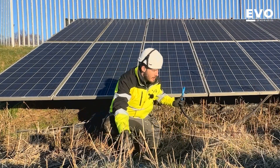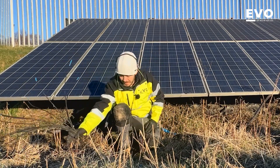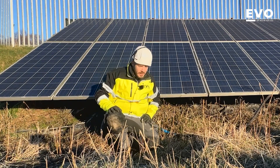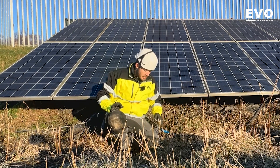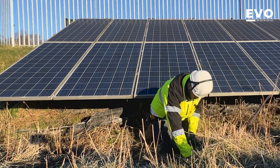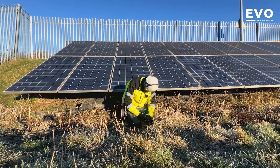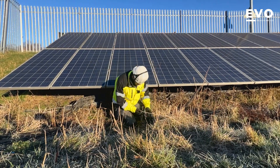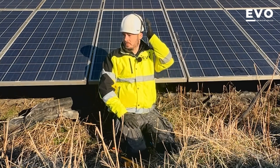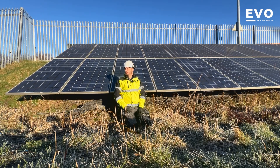So we have got a bit of a plan. We're going to pair up our strings to see what is a matched positive and negative pair, then we're going to bell out the supply cables from the inverter to find our pairs and probably look at jointing them — just so we're not changing the design too much. Obviously this isn't like SolarEdge where you can work on both ends, so we've got to work on one end at a time. And remember — it's constantly live.